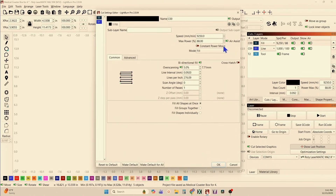I've got to save this again — this is not the right settings. I'll save it again and upload it again so it's correct, because I did this at a much lower speed. I messed up, but you get to see all of my mess-ups when I make my videos — I don't hide anything. I'll be saving this again and uploading it: the power is going to be around 10%, and the speed is going to be around 800 millimeters a minute. My cut speeds were 1,000 millimeters a minute at 100% power with about seven passes.